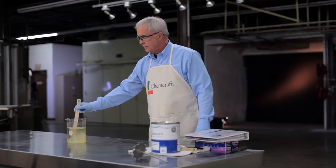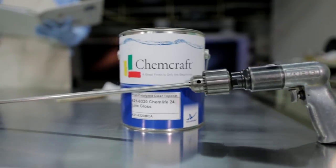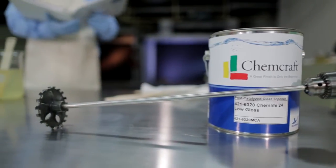This will help draw the heavier settled material up and through the coating. Stirring should continue for at least 5 minutes until you can feel that all of the settlement has been lifted off the bottom. Another method is to use mixing paddles that are powered by an air gun.